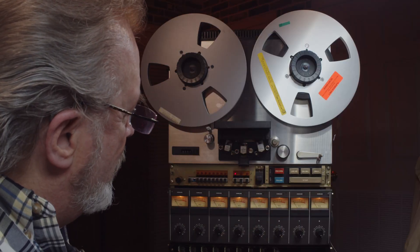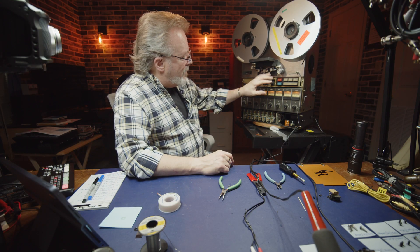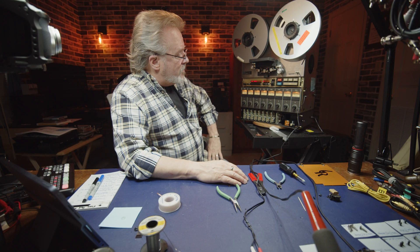I've got to get in there and literally scour the flywheel, the tape path, guides, heads, and all that kind of stuff — probably going to break out the Dremel and use a polishing wheel to get all of that crap off those heads. That's due in large part to somebody, including somebody bearing a striking resemblance to myself, running some very old stock of half-inch tape through here just to see what the tensions were and whether it was going to behave even remotely right. Having run that old sticky shed tape through there, it contaminated everything.